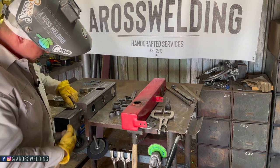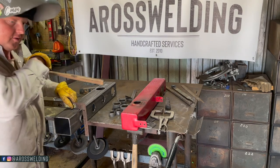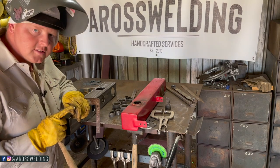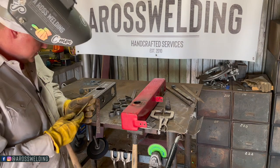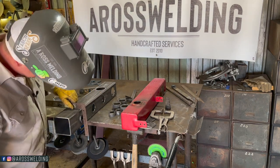And that's why I marked it, because my marks will get me close, but still yet, you got your soapstone. That's a 3/32 thickness. So I mean, 3/32 this way or 3/32 this way could throw your level or square off. So you can't even go off your soapstone.